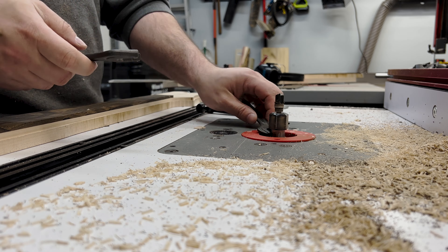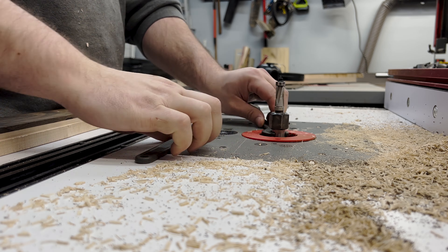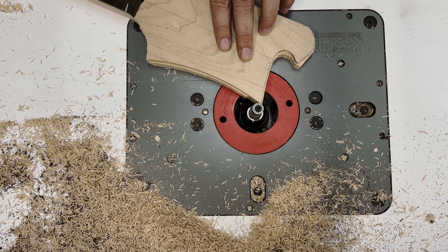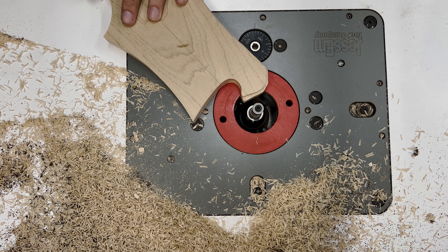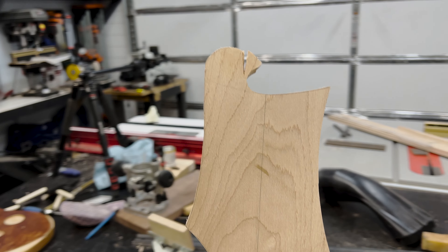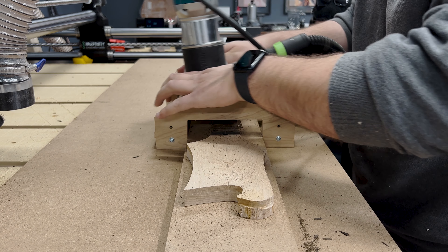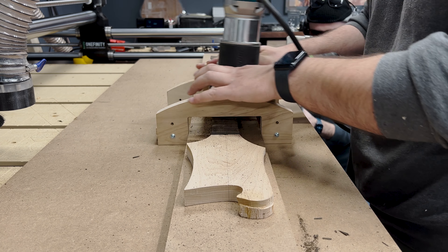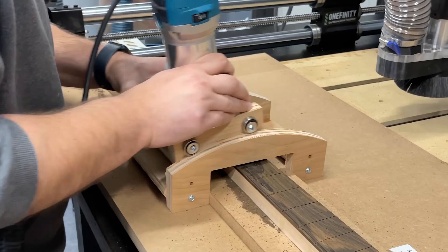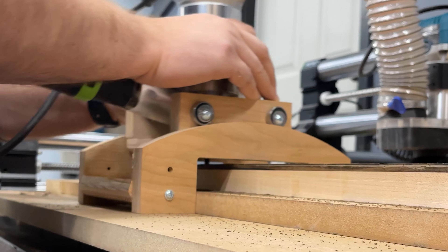Once the initial trimming was complete, I switched to the Mega Mini flush trim bit — I'll leave a link in the description. The neck was turning out clean and I was at the home stretch, until I made a big stupid mistake. I fed the headstock the wrong direction and the bit threw the neck across my shop, leaving a nasty tearout. Luckily it was intact enough to glue back into position. After it dried, Sean and I developed a radius jig to get a perfect 9.5-inch radius along the fretboard, which is typical for a lot of bass guitars. Rather than spending $200, we built it from some scrap ply and bearings instead.